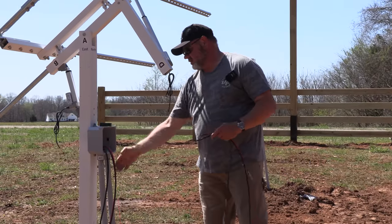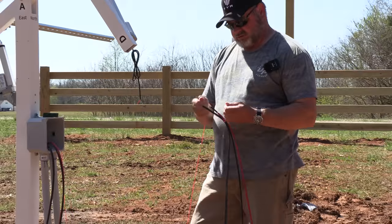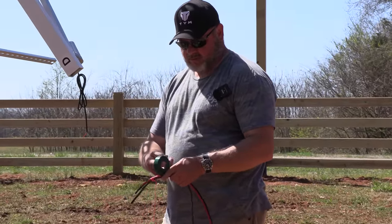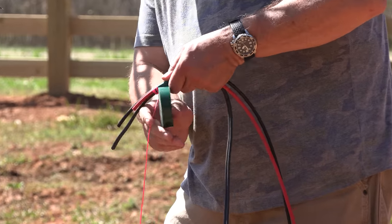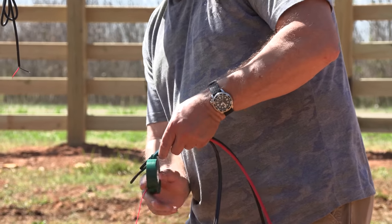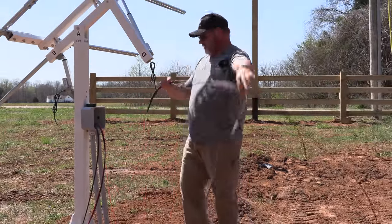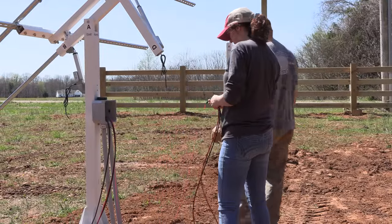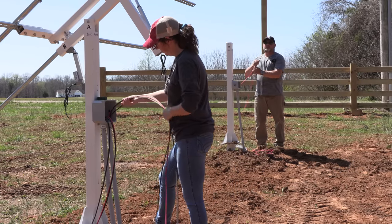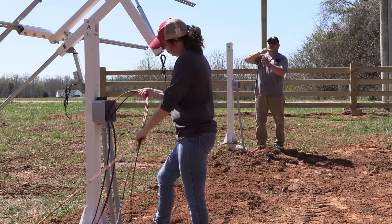Again, we're going to take our string and tie a knot around the wires to hold them together — I staggered the wires again, one wire at a time basically. Don't make the tape really thick with big knots because it will hang up in the pipe. This time, Natanya is going to pull from the other end. We put the wire out straight this time so it should help. She's pushing in a little bit as I pull the string — just a little bit of help to make that turn.